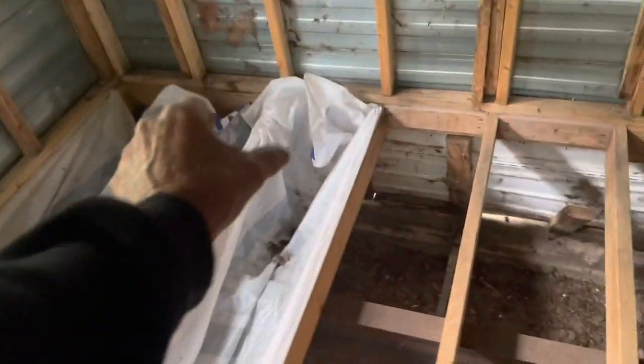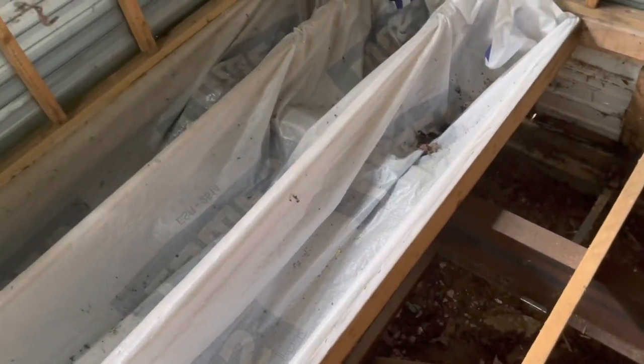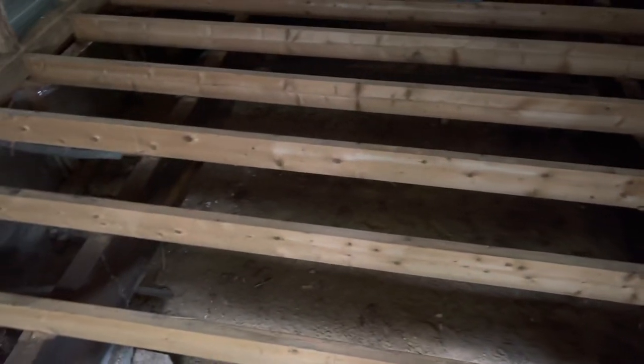So now he can drop a row of insulation right there, and he can drop another row of insulation right there and right there, and then just keep continuing on down through here. He'll have an underbelly that will be pretty awesome. But most people don't have the opportunity of replacing the underbelly from the top side, so I'm going to tell you how you can do it on your house from the underside.